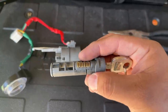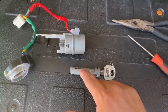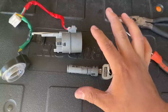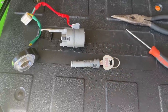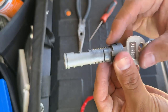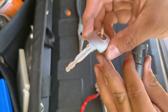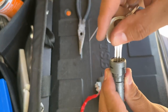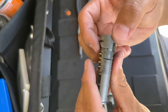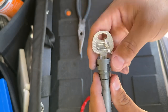We have an eight-cut key, so there are eight wafers. The key holds these wafers in — they're spring loaded, with little springs inside each one. If you pull the key out carelessly, they'll go flying everywhere. The key way for this one is an HY15 Hyundai key. This is the working key, and what we're going to do is move a few of these wafers so we end up with a completely different key cut.